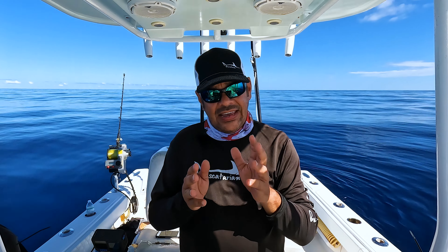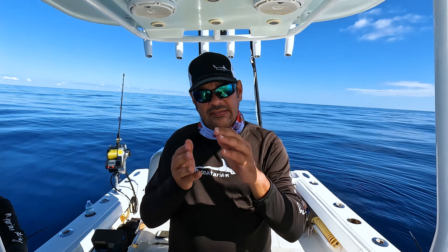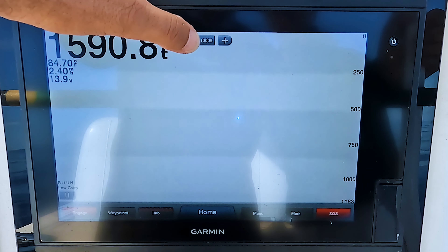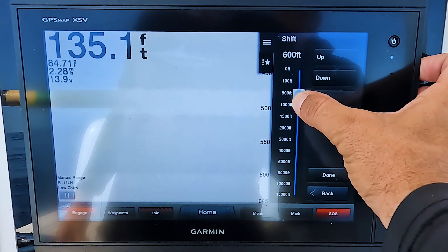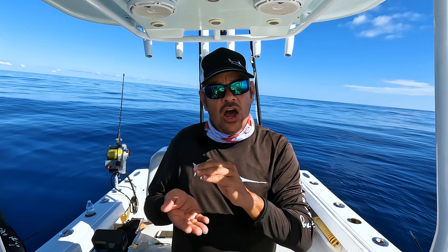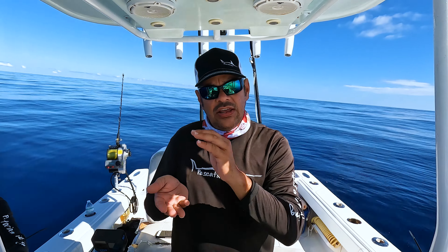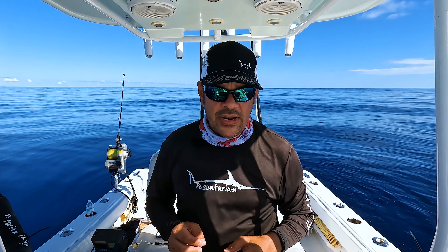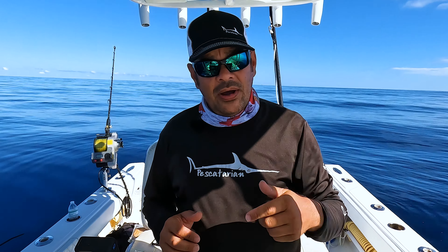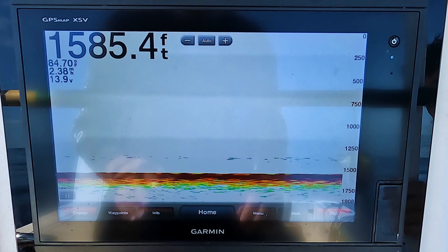The feature that I'm talking about is the Garmin Sonar Shift feature. What this allows you to do is see with extreme detail what is on the bottom, because what you're going to do is select a depth range for your sonar and — no pun intended — shift your screen to only look at that section off the bottom. Your sonar is only working and focusing on the section that you have selected, which returns a much crisper and cleaner image to your sonar screen. Now let's jump right in and show you how you can do this on your Garmin screen.